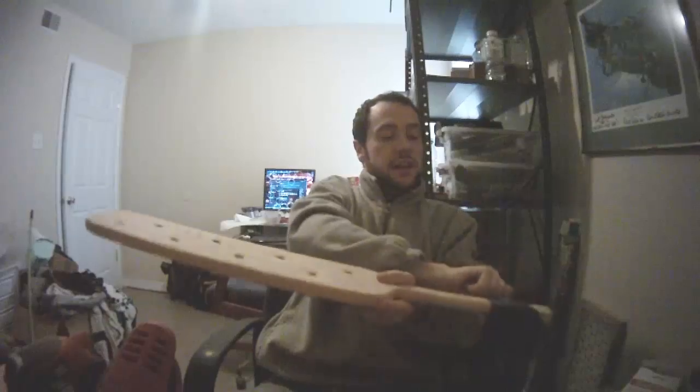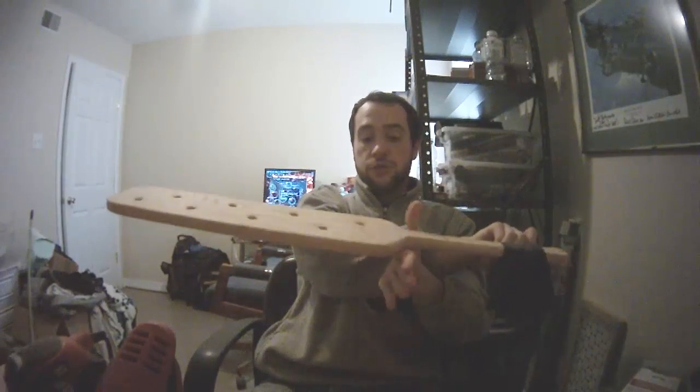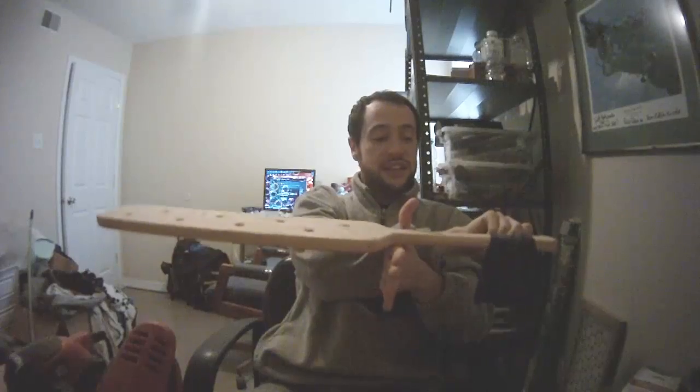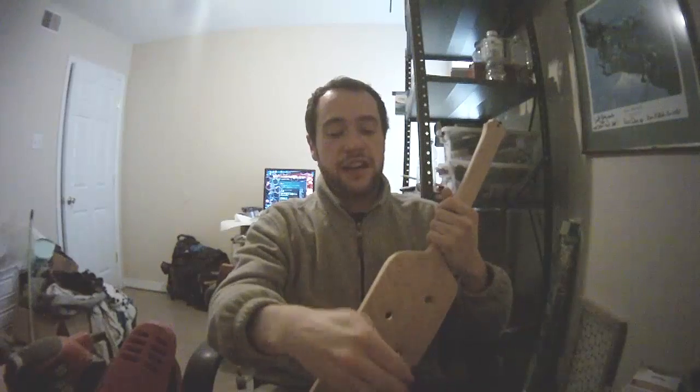Third is the counterbalance issue. This took a little bit of figuring out. I found that these steel ball bearings that I have, three of them was exactly the right amount of weight that I needed to counterbalance this. In fact, if you use the new fulcrum on that and tie it up, these are pretty much going to balance this thing out perfectly when everything is said and done. I have a little bit of force down here just simply to hold the bag on, but at the same time, it's pretty damn near close when I tie it up.